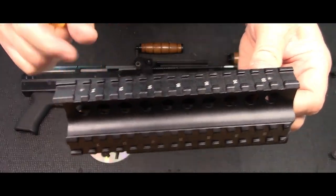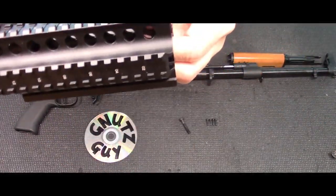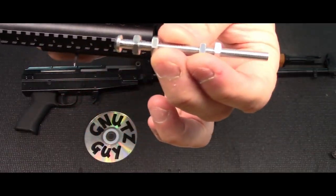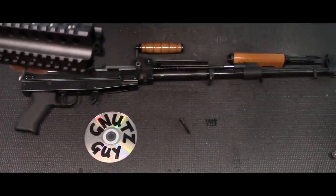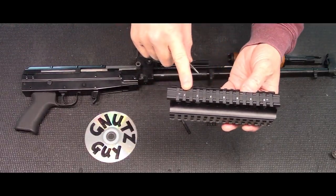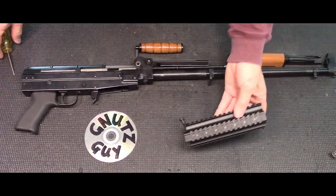The back one you're going to be drilling 6 millimeter because it has to accommodate an M6 by 0.75. And the front, 5 millimeter — you need to accommodate a screw which is a 10-32 by 3 inch long. Now should you not have metric drill, the back you can use a 15/64 and for the front you can use 3/16. Actually, that's what I'm going to be using.